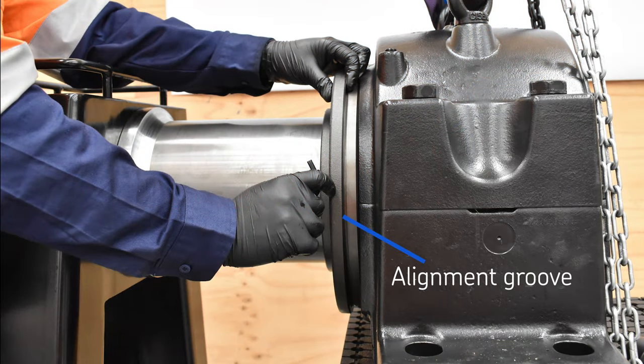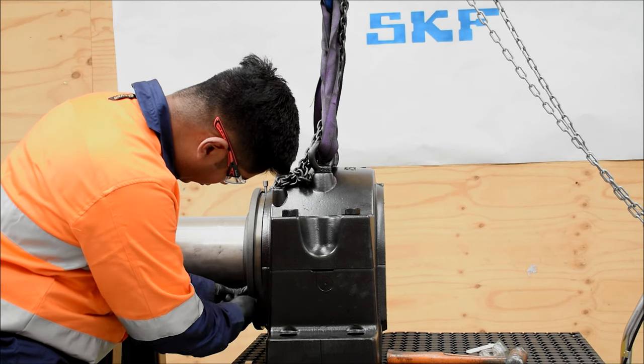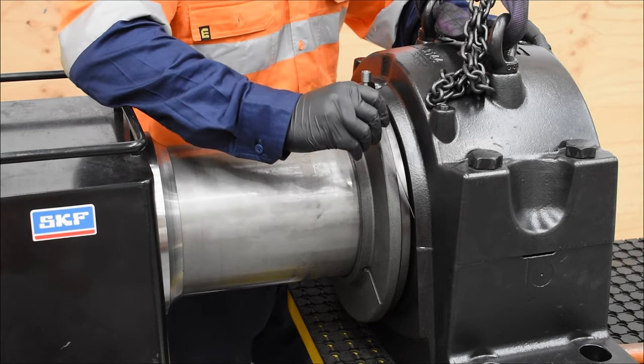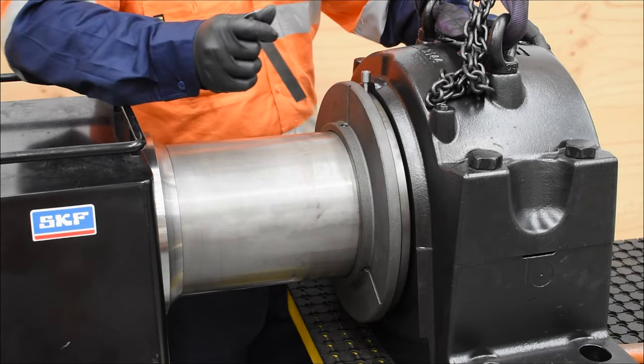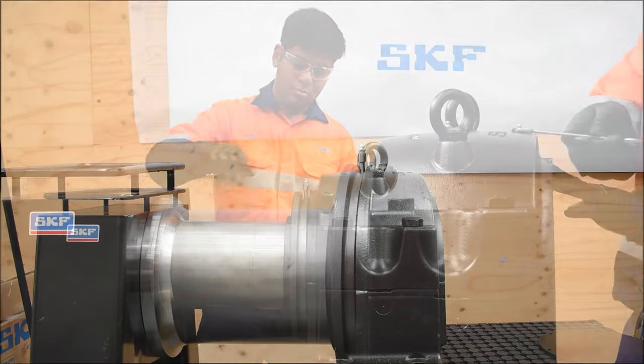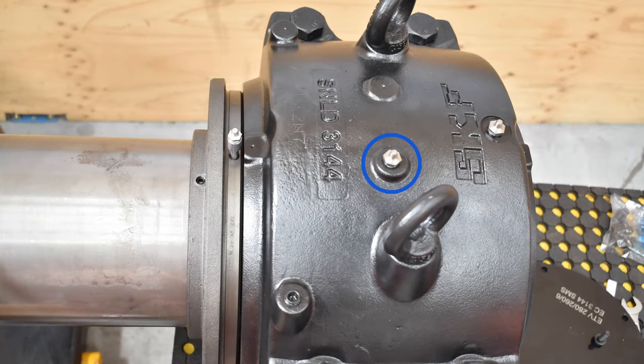Complete a visual inspection for the alignment groove opposite to the grease adapter and tighten the remaining grub screws to approximately 5 Nm. Please take extra caution for the non-locating floating bearing end while adjusting the housing position. Carry out final seal alignment after this step to ensure correct installation. When completing final in-situ installation, use the alignment groove to check the angular alignment of the labyrinth. Shim or otherwise adjust the housing as needed to minimize misalignment. Seal the interface between the seal carrier and housing with a bead of silicone. Insert and tighten the grease supply adapter. Attach grease supply and fill the labyrinth completely with seal grease. The grease nipple location will be dependent on the position of pre-lubrication — center from the W33 groove on the outer ring or side from the side face of the bearing.